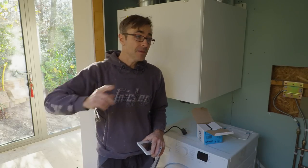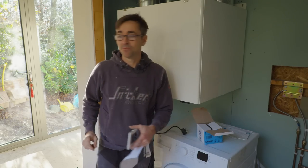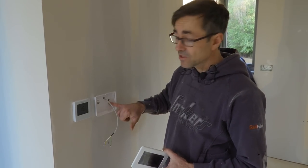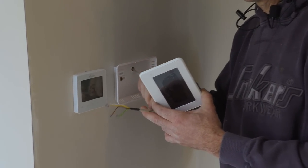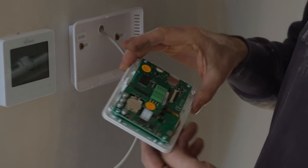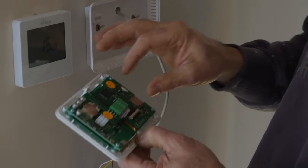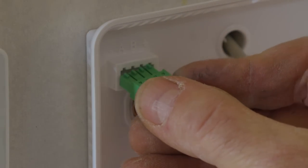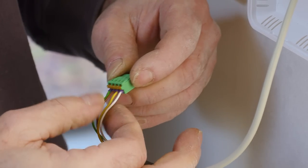All the valves are in the ceiling. We're going to plug the unit in once I've fitted this control panel, then balance the system. I've mounted the back plate on the wall, pulled my cable through, and made the connection inside the unit following the instructions. When I came to the back of the controller I was a bit puzzled about which wire colors go where — but this is genius: when you pull it out there's a little port that you plug in, and it says A and B which relates to the manual giving the terminal colors.